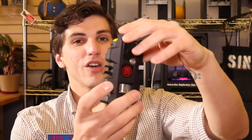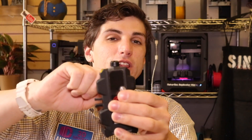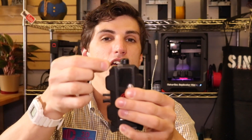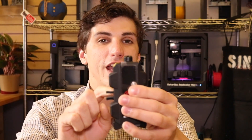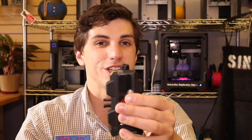Since the release of that video, MakerBot has released the Smart Extruder Plus, which is a lot more stable and has a much longer life than the original Smart Extruder, but it has one of the same problems the original did. When the filament is withdrawing, if you tug it, a small piece will fall down and get caught inside the extruder causing a jam when you try and feed filament into it. In this video I'm going to show you how to take apart the MakerBot Smart Extruder Plus and get it back up and running in no time.